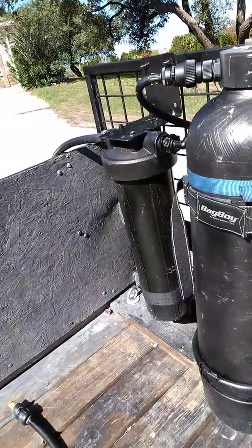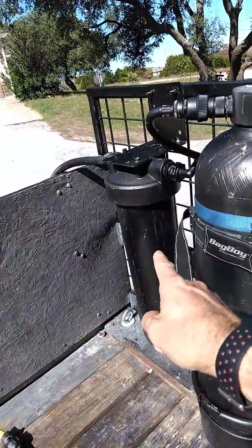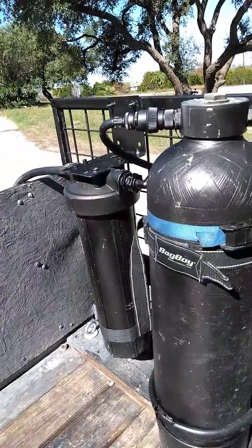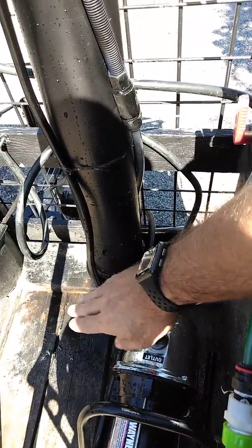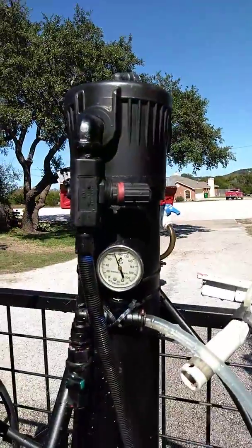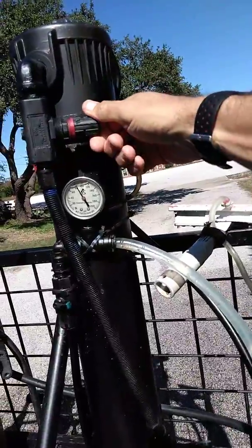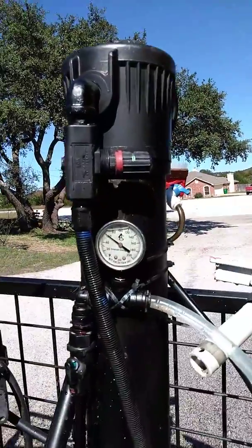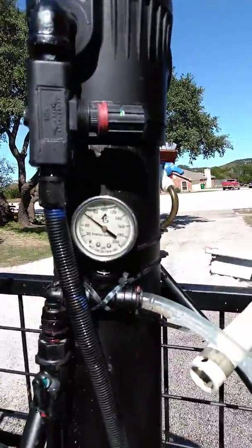You might have to boost, but that cost me a dollar. The filter is 40-50, but the housing and everything — a dollar at a yard sale. I put the quick releases on there just in case I don't want to use this at all or I have to dismount it and put it up more towards the house. Incoming pressure is just about 82-84, which is awesome for this area. Working pressure is about 60-ish.